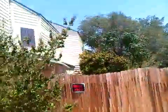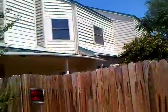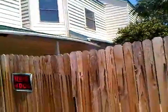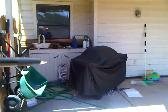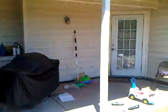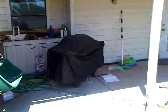As we continue around the back here, kind of more of the same here. We got a couple more windows. All windows will be flashed and wrapped in a 1x4 Hardie. And then here, basically this little storage container, we're going to pull that away from the wall all the way down to the ground level. Wrap here are the posts. We have 4 posts again that if the homeowner chooses, we can wrap in Hardie.